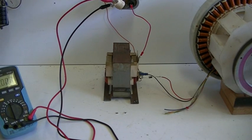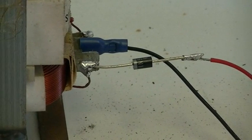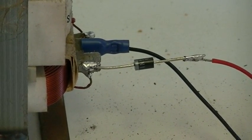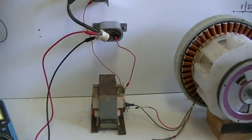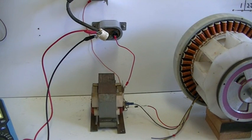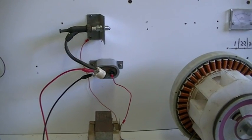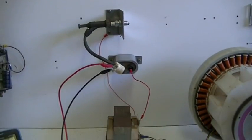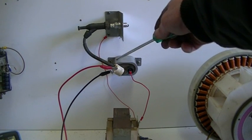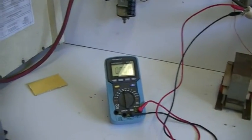With our microwave oven transformer in place, you will see down there I have a diode on the input — that's good for 1000 volts, 6 amps, which we'll be nowhere close to. We then go up from there into a 0.75 microfarad cap, and then up to a spark gap which I'm just using an automotive spark plug. And I've just placed a small coil from a solenoid over the spark plug lead so we can get some idea of the frequency we have down here.